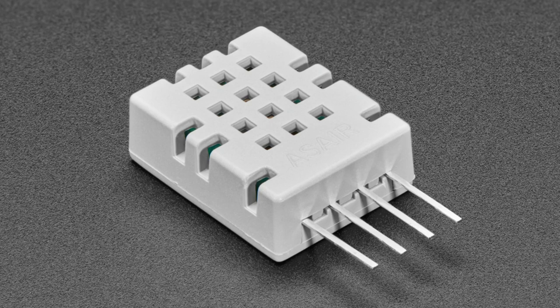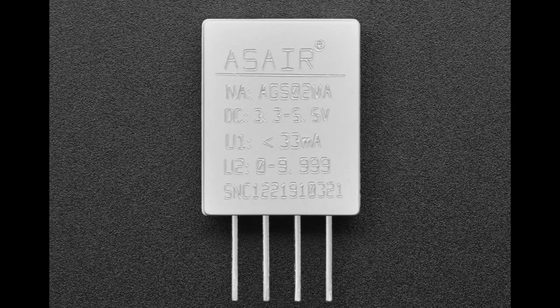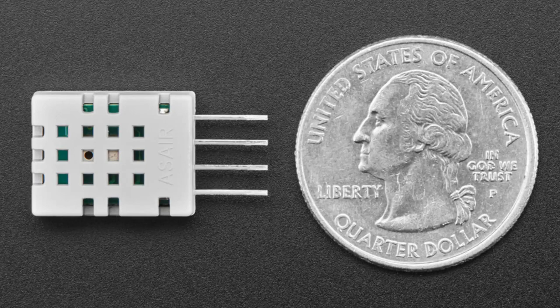So did the Atmega328. But there are other chips, the SAMD series, that were not very happy about running at that low speed. And so just be aware that you have to make sure, maybe check on an oscilloscope, that you can run your I2C controller at 20 kilohertz before you pick up this sensor. Other than that, it works pretty well.